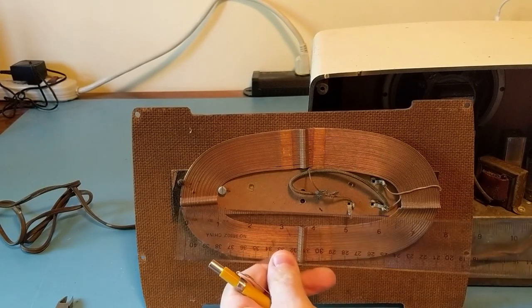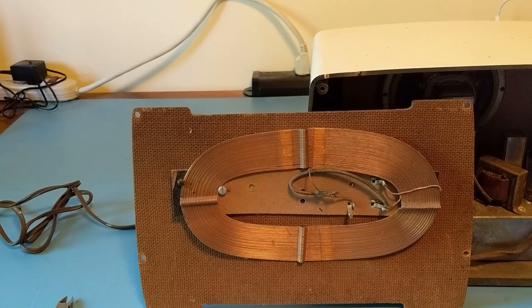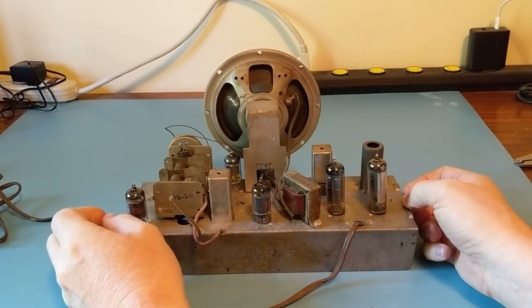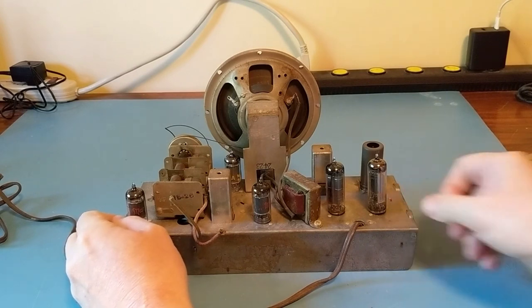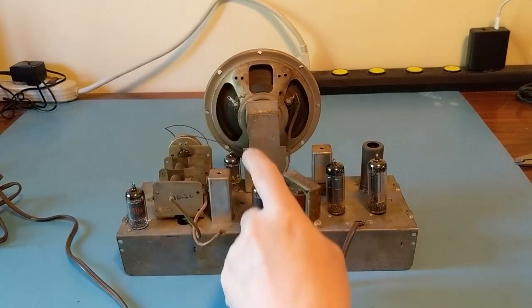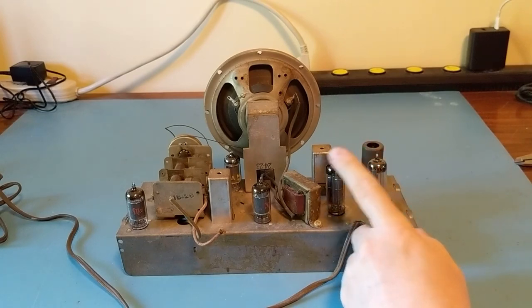Total width of the coil is 8 inches by 4.5 on the outside. The radio is basically the same chassis, same tube layout. The air condenser seems to be exactly the same as the Sentinel. The tube layout is a 6BJ6, 12BE6, another 6BJ6, a 12AT6, a 50B5, and a 35W4.